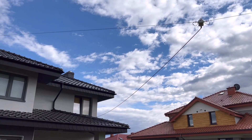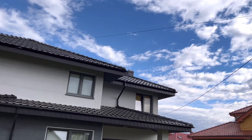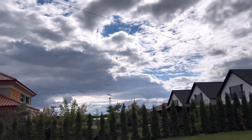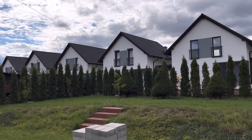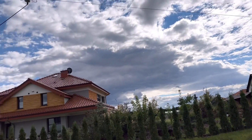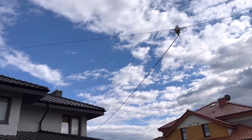From the 4:1, coax runs up to the back room where I'll be operating from. This is the shorter end — the one-third end — had to do it that way to get the coax to the room. There's the two-thirds, the longer side, going down to the fence at the back of the yard.